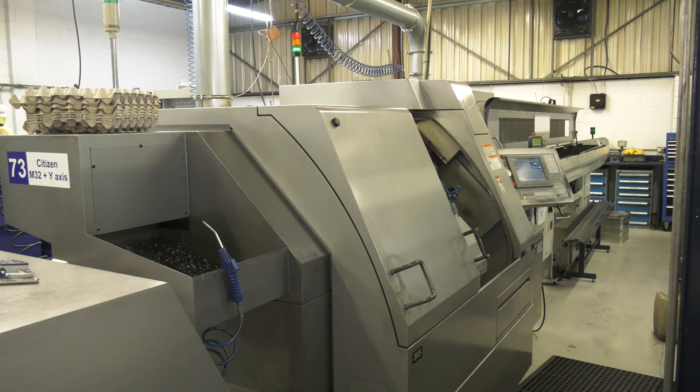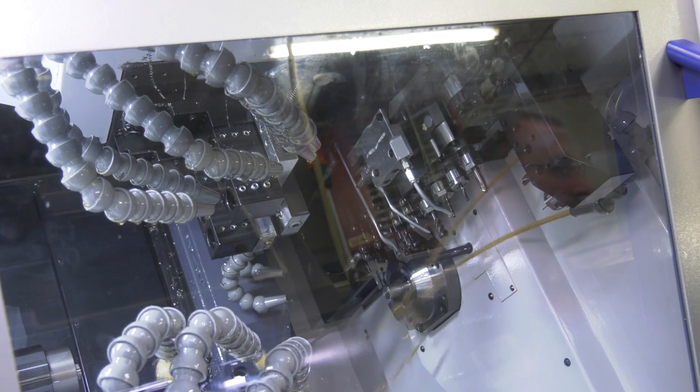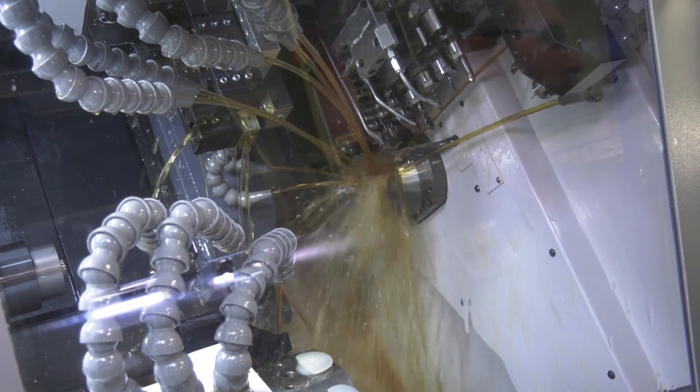At the moment they've got a catalogue of so many options, and as the machine goes on, I imagine they're going to expand that. That modular system is on the top of the back, whereas before on the older machines it just had three turning posts — now it's almost like it's exploded with tooling. From a manufacturing and production point of view, you could also have tool posts to suit specific jobs, keeping preset tooling in your tool stores and pulling them out when needed. Setup times are down, and tool functionality can be monitored once the job's done in the tool stores and then brought out next time the job's on.